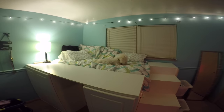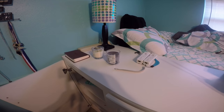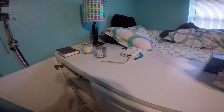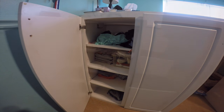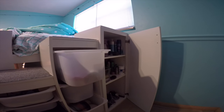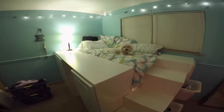Now that the MDF is secured in place, I prime and paint the tops of the board. Next I install a set of rope lights on the underneath, and finishing up the project I glue low pile carpet to the stair treads. That completes my DIY bed project. In total I had about two and a half days labor and a cost of roughly $240 — I did have some materials on hand. This was a relatively easy project, offers great storage options, saves cabinets from being in a landfill, and of course saves you money. I hope you enjoy doing your own project. Thanks for watching.